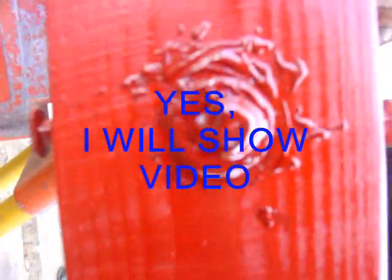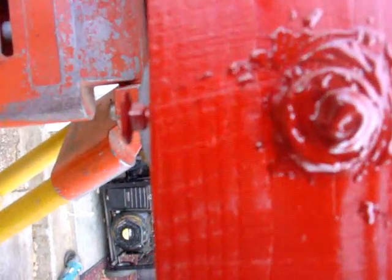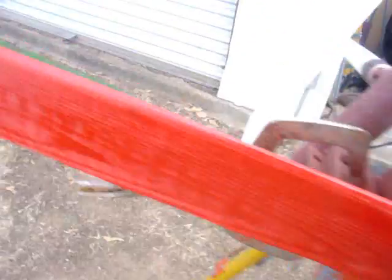This bolt here is just in there for a counterbalance to the one we ground into the shaft. You can see into the shaft a little bit — there's a small dent in there. I took an angle grinder and ground the slots. Now we have a lock bolt just long enough to go in there with a little bit hanging out.